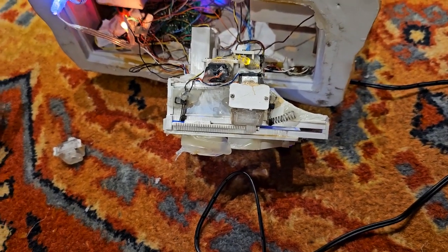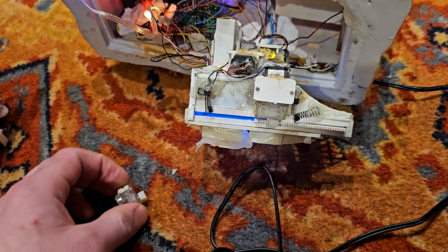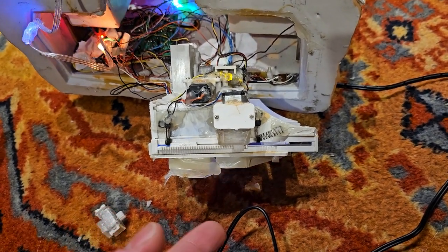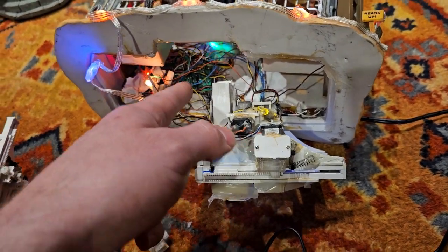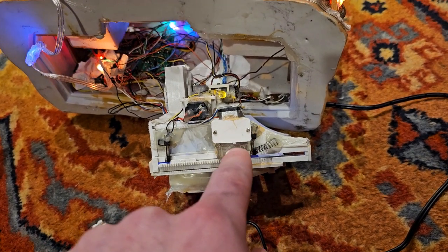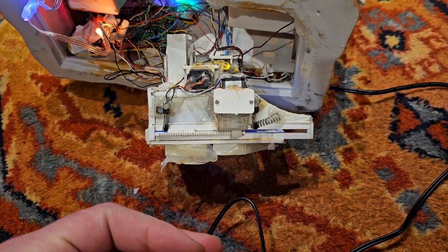And then I was able to sort of piece together and put in another gearbox from a parts building that we bought to try and just get another gearbox going for the gate motor, and that one was fine, and I shipped it back. And then unfortunately the guillotine had issues due to a transistor failure on the board, and I was able to replace that. And then I sent it back, and then this stupid gearbox failed, and it would go up and then occasionally not come back down for like 2 times.